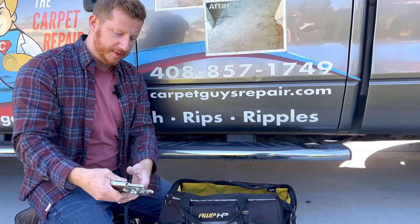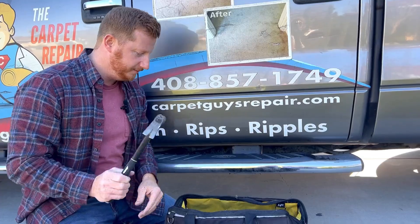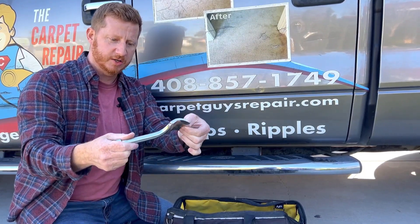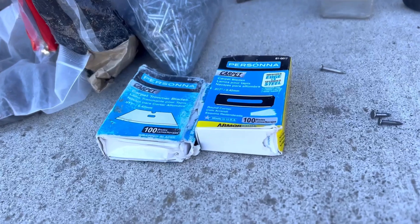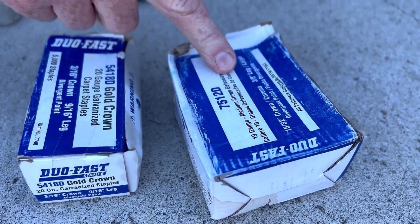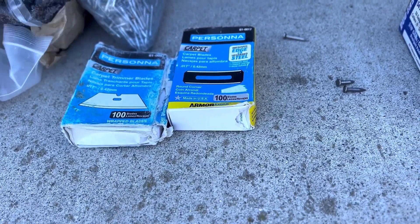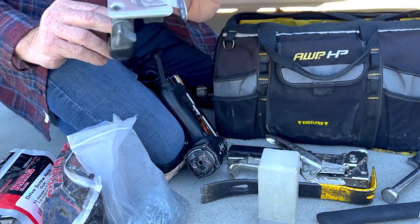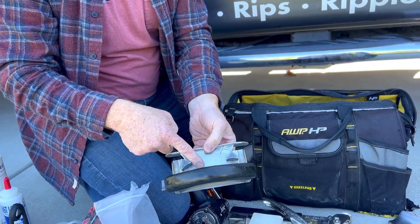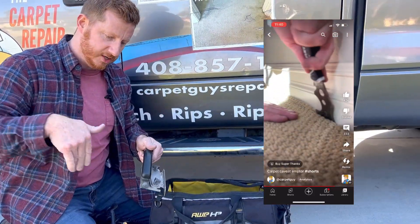Sometimes you don't need all these tools — some guys just use this end of the hammer to pop that down and cut it. Here's a beveled stair tool; I like the contour and control I have with this one. My blades, my staples — this would be for the electric staple, this is the pad staple, and this is for the knife. These angled blades are for the carpet trimmer right here. It has many settings based on the thickness of the carpet and the baseboard gap. You can set it to cut the carpet and trim it quicker than cutting by hand, and then tuck the carpet.